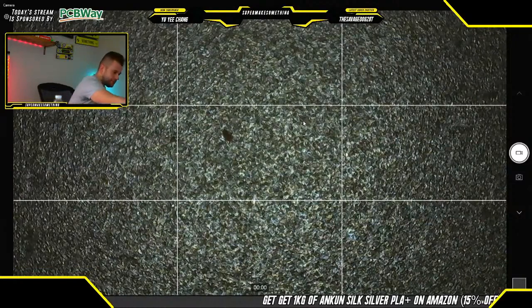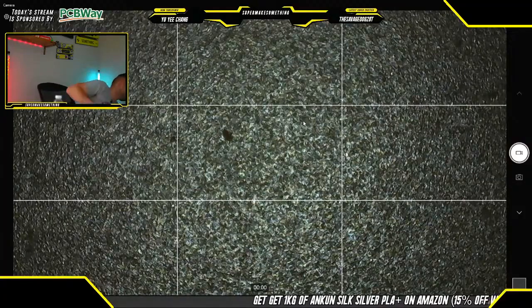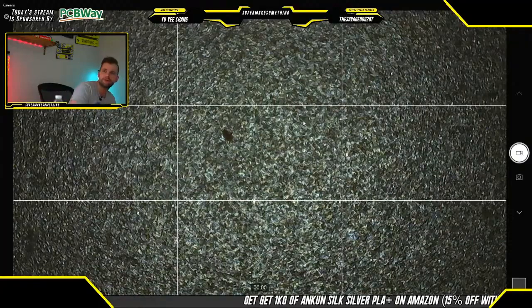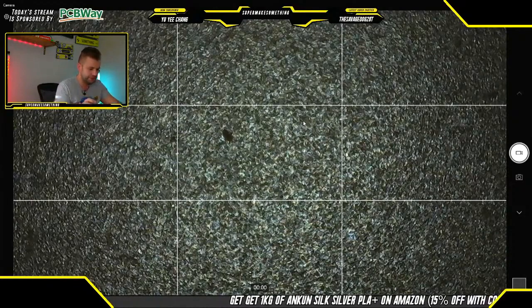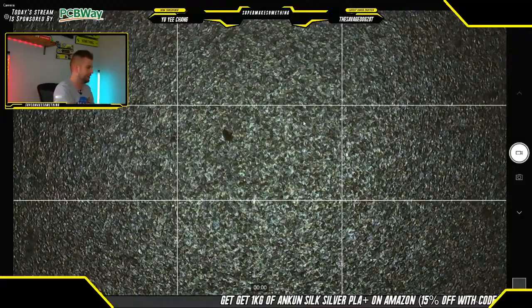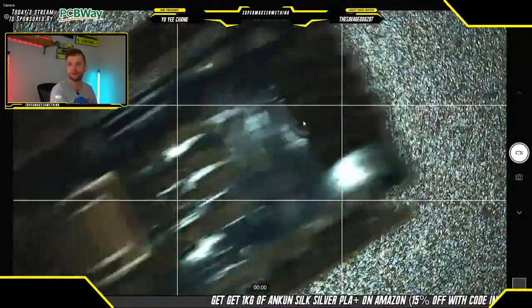Alrighty, first things first, soldering iron on. And the other thing that we're going to turn on here is a fan. This fan has a filter built in, and that basically is just to draw the solder fumes away a little bit, just so that you're not breathing these in while you're soldering, because that's not the greatest thing to do. And then the first thing we'll take a look at here is the Arduino Nano, which is right here.